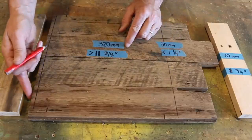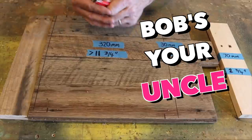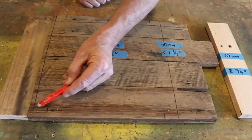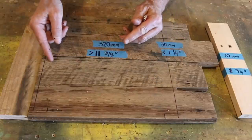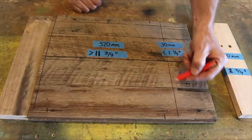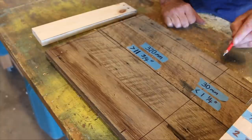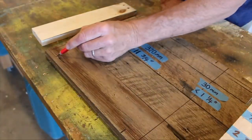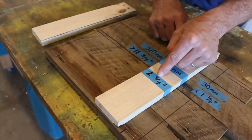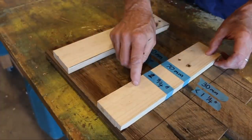The next thing we need to do is get a straight edge on one side. Just grab a piece of wood, bang it up against it and Bob's your uncle. From that edge, come in 10 millimeters — roughly half an inch — and mark a line from top to bottom. Come across our 320 millimeters to the other side and mark that line. From those two fresh marks, come in 30 millimeters, which is a whisker under an inch and a quarter, and place a mark top and bottom on both sides. I've got two pieces of pallet wood, 70 millimeters wide — about two and three quarters of an inch — and I'll place these on those marks, then simply glue and screw in place.